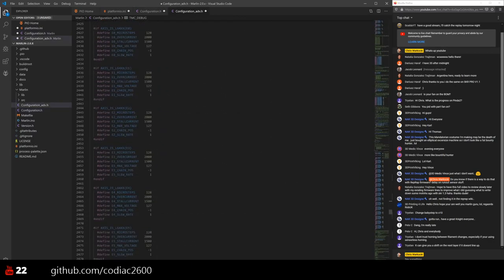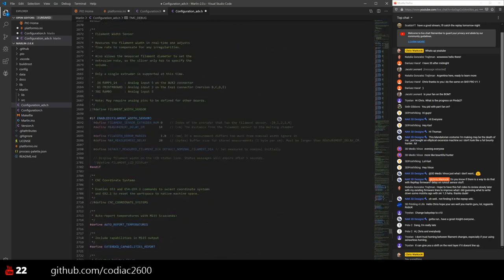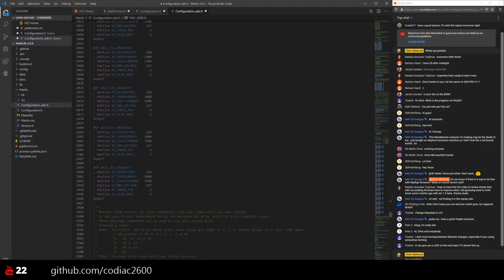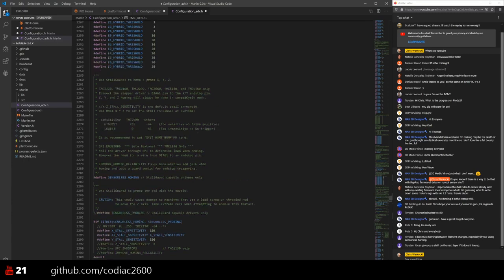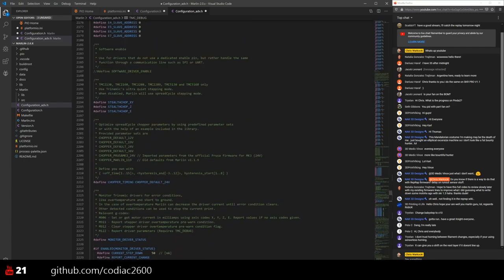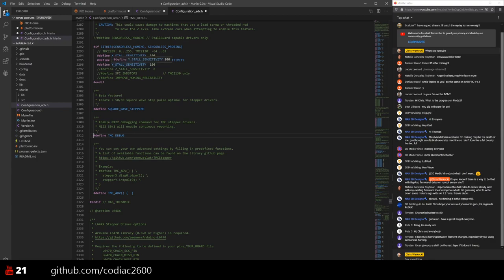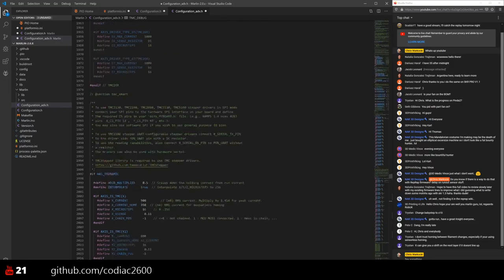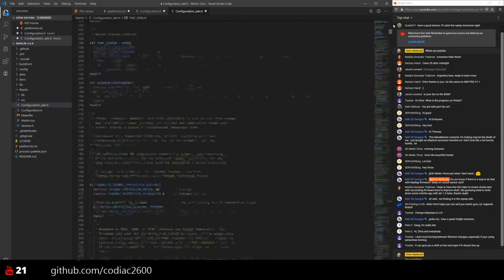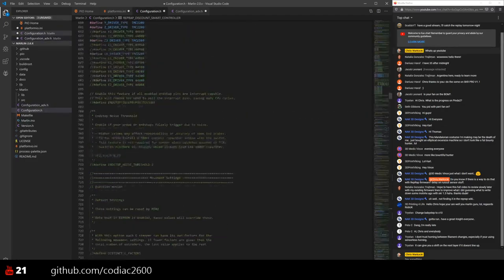And when I go over here to look at the fancy filament with sensor, let me go back up here to the Trinamic nonsense. So, yep, we have stall guard only on the X and the Y, and we have stealth chop on X, Y, Z, and the extruder, which is perfectly fine. So we have to do some changes in here to allow us to do some fancy things. So filament runout sensor, we enabled. But to use the PINDA, we have to do some stuff. So let's go back here and talk about this.